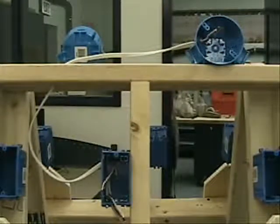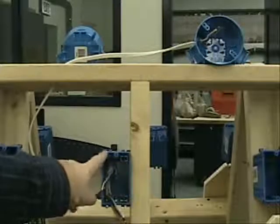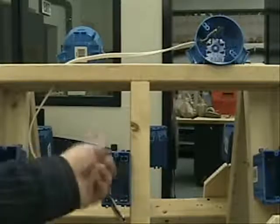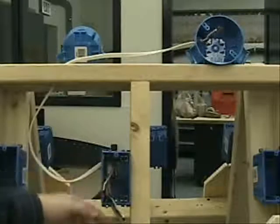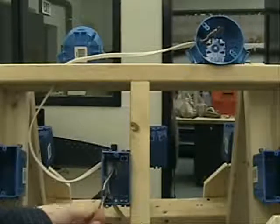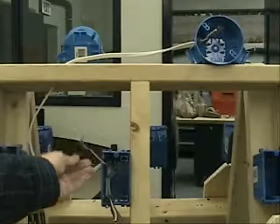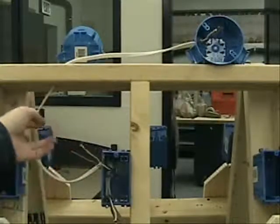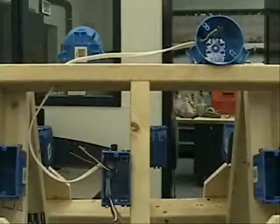As you can see, I've already ran another piece of Romex between what's going to end up being my outlet box for a switch. So I'm going to have a light switch here. It's going to have a piece of Romex bringing my power in, and I'm going to have a piece of Romex that will take power, once I flip the switch, up to a lamp post which will go up on top there.